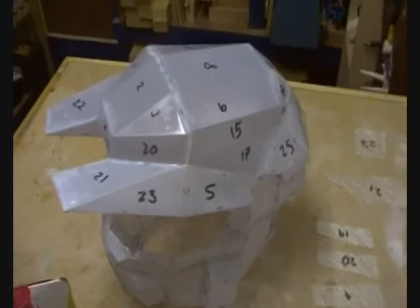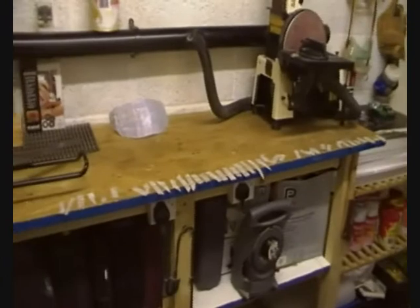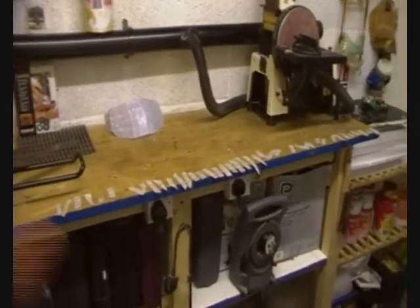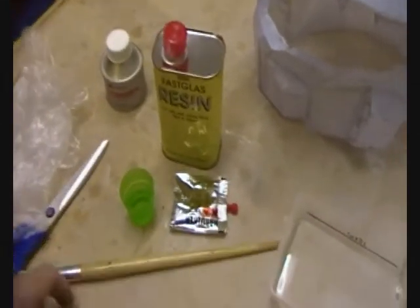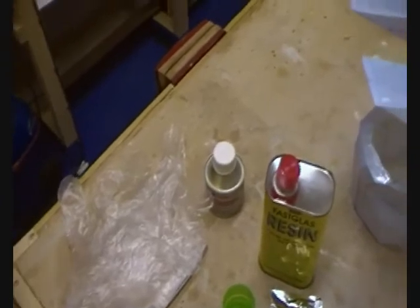And that's it. So basically, when you're fiberglassing, the preparation has to be spot on. So I've cut the mats to a rough size. Around the edge of the workshop, you can see on the edges I've actually put some strips that I can use to cross them across. And I've also got all the materials that I need, the resins, the hardener, and also the cleaning up part to use straight after with the disposable gloves.